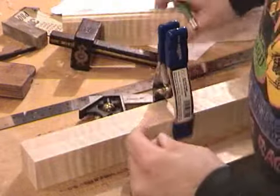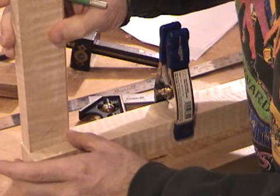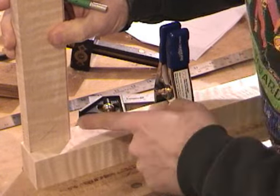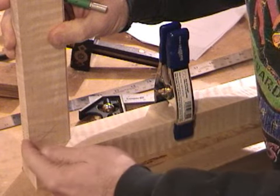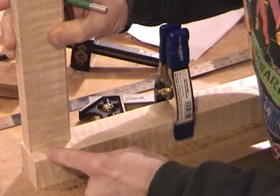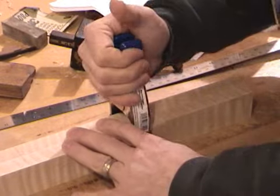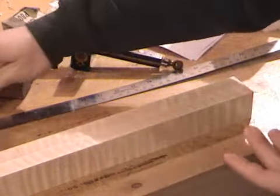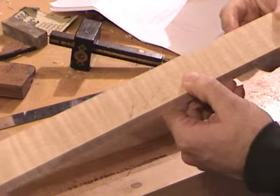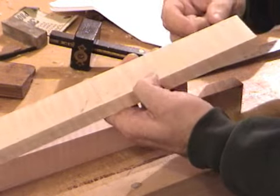Let me just check — that should line up. So right at this point now, the outside edge and this new scribe line that we've put in place should be this width. And ultimately we'll start the tenon right here, which is that inset line. We'll do the same thing on the other end. With that, we have the layout marks on one edge. I'll rotate and transfer these marks around to the other side, keeping the same distance for the mortise on both surfaces.